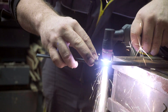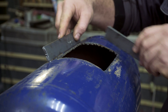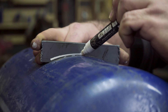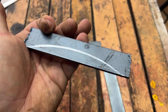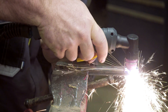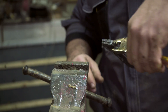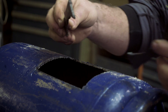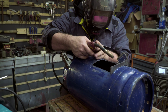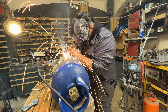I need to make a frame around this door and I can cut metal strips for it. These are quite thick but no problem for this plasma cutting machine. I have four pieces that I align to make a frame to mount on the gas tank. Since the gas tank is rounded, I mark its shape on the pieces too. Cutting a small circle with an angle grinder is almost impossible, but with the plasma torch it's easy — even cutting two pieces stacked is no problem at six millimeters thick. The parts align perfectly and I fill all the small holes with the welder. In just two minutes the window frame is complete.